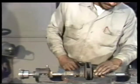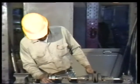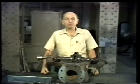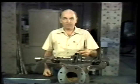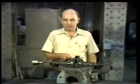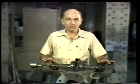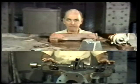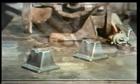Then check the fit of the casing wearing rings, and as a quick check on the bearings, see if the shaft rotates smoothly without any drag or uneven motion. After this preliminary inspection of the casing, the impeller, the casing wearing rings, and the bearings, make the necessary preparations for removing the rotor from the lower casing. This means having a pair of V-blocks set up and ready to receive the rotor once it's removed.